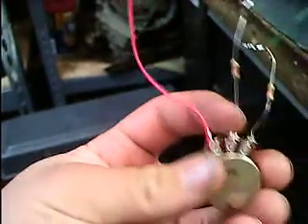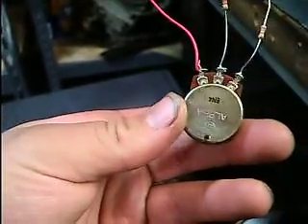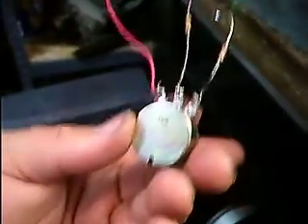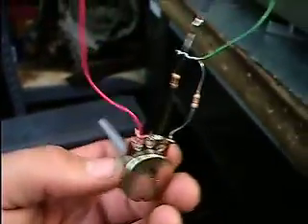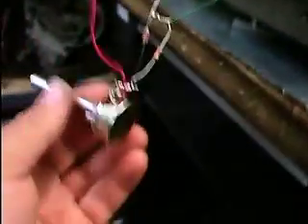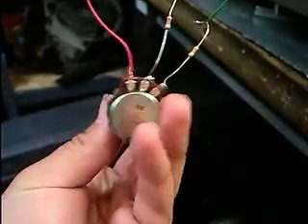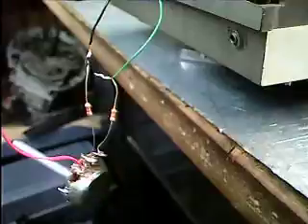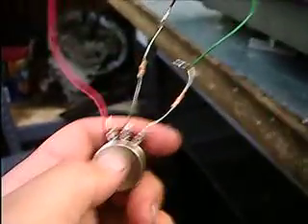Also, for the 8,500 ohm pot, I added another 3.3k resistor to the wiper arm inside there to just try to boost resistance. I don't think I have it quite bright yet, because it seems like the monitor should be brighter than it is. Although it is pretty bright and you do have a good adjustment with this now. I'm sure that by adding maybe another 1,000 or 2k, I can get it even brighter.